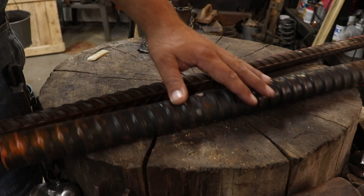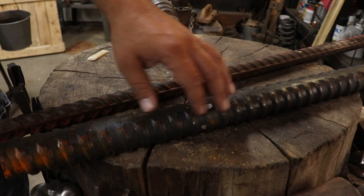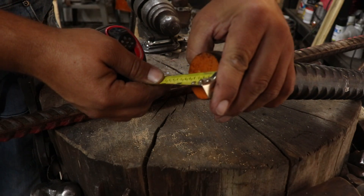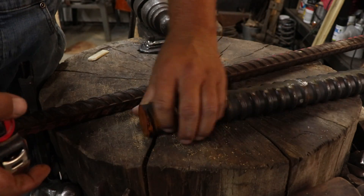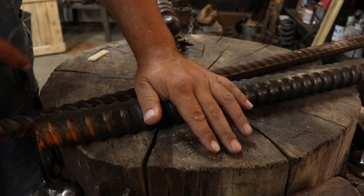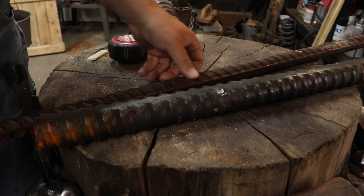This week I would like to do some testing on some mystery steel because I need some more tooling and this is good heavy material. Now this first one is a beastie piece of rebar and it is almost inch and five-eighths. It's a pretty good chunk of material and I was thinking about using this for maybe some bottom tooling, top tooling, maybe some fuller, something like that.